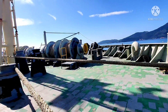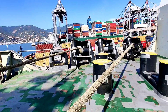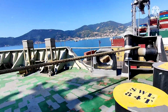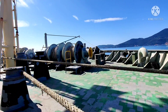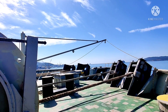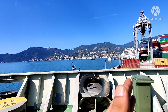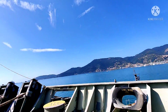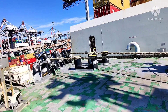The springs restrict the ahead movement so the vessel does not move ahead. Both ropes have different purposes. On the aft station, the stern lines keep the stern alongside, and the spring lines — which go forward rather than aft like on the forward station — restrict the astern movement. This arrangement is known as a four-plus-two arrangement, as we have passed four head lines and two spring lines. We always count the mooring configuration clockwise — four head lines plus two spring lines. You say four plus two, not two plus four, to avoid misunderstanding.